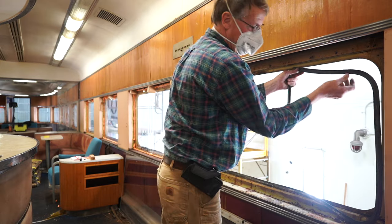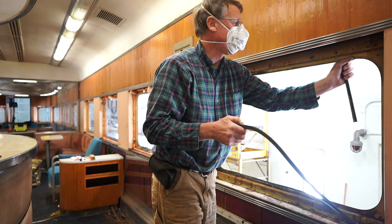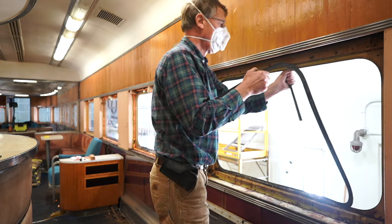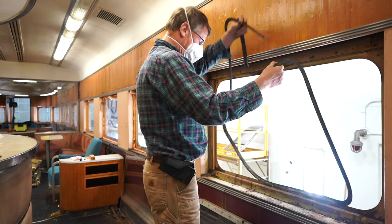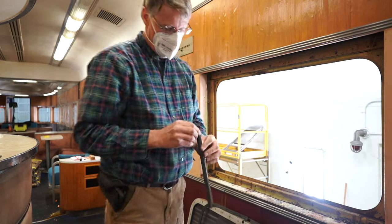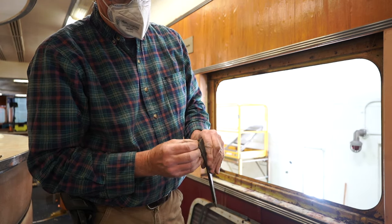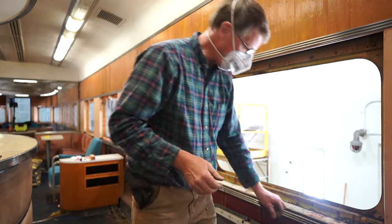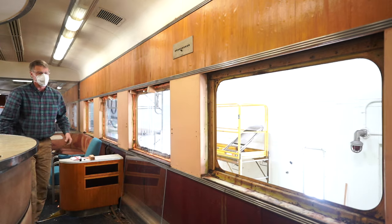So you got the existing gasket that just sat on this exterior little eighth inch or less, it's 14 gauge I think it is, steel edging. All the gaskets are dry rotted and whatever, but the profile was a simple little edge that's set around the metal, and then the inside just is a fluted face that goes up against the aluminum frame. Pretty simple detail now that we have figured out.